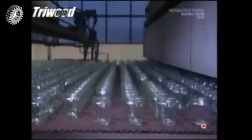To make sure there are no imperfections, the fresh jars pass under a series of flames. This seals any small holes there might be in the glass. They're then cooled with a quick blast of water and get sent to a room where they'll sit for 2 days at 30 degrees Celsius. If you were to put hot spread into cold glass jars, you'd get condensation and moisture. No one wants that.